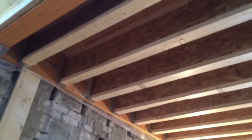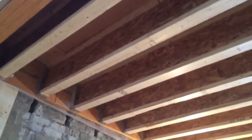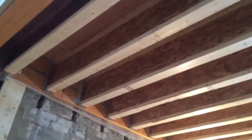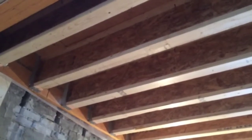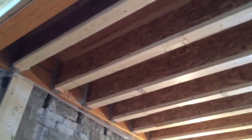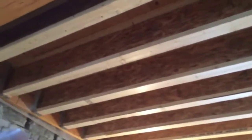If we had a 21-foot span and the joist span capacity was only 21 foot 2 or 21 foot 3, you're really pushing the limits — you don't want to cut it too close. So we went with a joist that has a 22 and a half foot span capacity, which ensures enough capacity for these floor joists at 16 inches on center to sufficiently support the load on top.